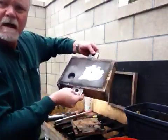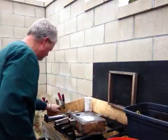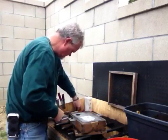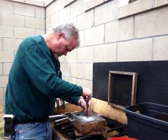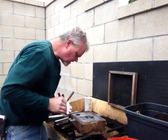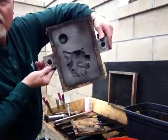OK, so here's the first half of the mold and there's the pattern still in there. I tap it a little bit just to loosen it up from the sand, and my handy little extraction tool that I screw into the back of the pattern. And very gently lift that pattern straight out — it comes out nice and clean. And there is the mold.